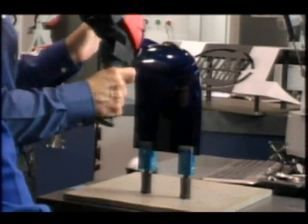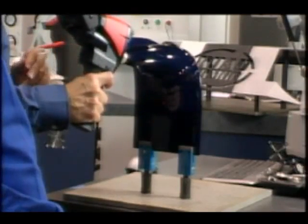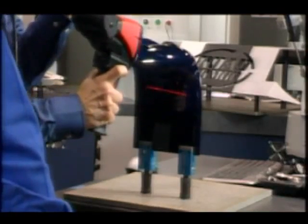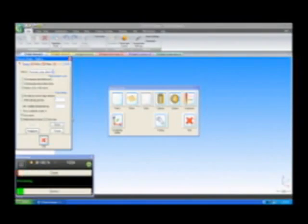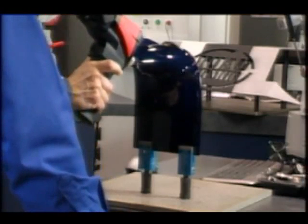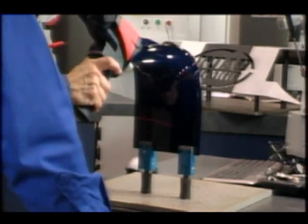This is a highly reflective piece, so I want to capture how much this material reflects back the laser line. The Romer Absolute 7-axis arm with the integrated RS1 scanner can do that with one click. I'll position the laser line on the piece and click a button — you'll see in the lower left corner that the system has automatically calculated the correct exposure and laser power based on this material and changed the setting. So if you change surfaces, just push a button and it automatically sets sensitivity to the reflectivity or color of that surface — even right in the middle of scanning.